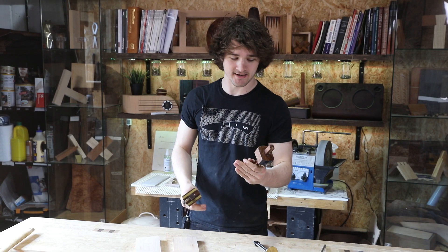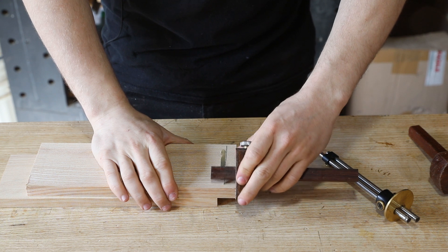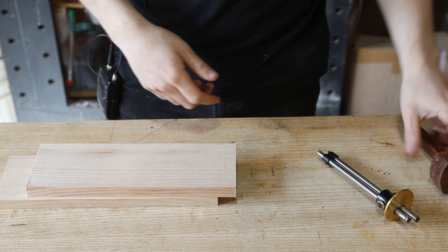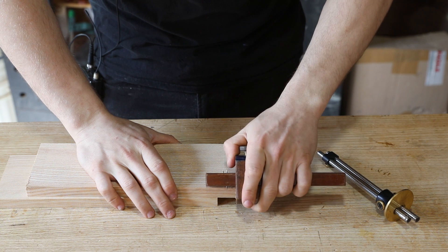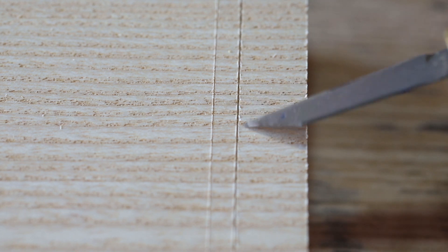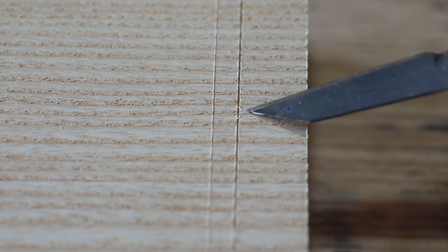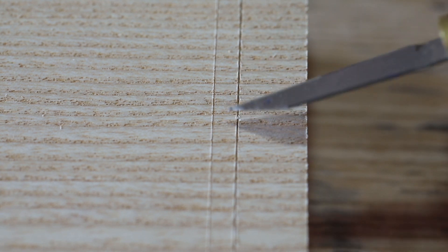Now I'm going to show you the difference between a marking gauge fitted with a pin and a cutting gauge fitted with a knife. Starting with cutting across the grain - with the cutting gauge we'll tilt it back, light pressure, and do lots of passes as I just showed you. Now let's do exactly the same with a pin marking gauge, set to the same offset, tilt back, light pressure, drag back. You can see there's not a huge difference between them. If you apply the techniques of reducing the pressure and reducing the angle of attack, you still get a pretty good result from something that really shouldn't be used to cut across the grain.